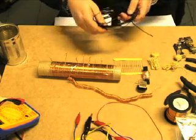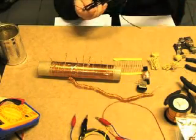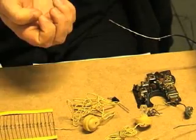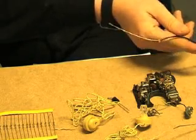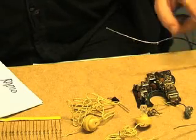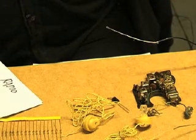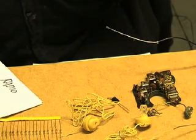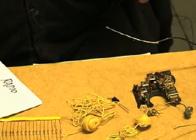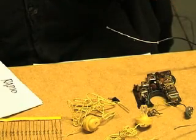A very crucial factor in crystal radio is the antenna, or as some people call it, the aerial. You need to have as much of the aerial spread around the space as possible. If you have an antenna that's only 10 feet long, you are not really going to receive anything. From this table I have 20 feet of wire going to the window, and outside the window hanging down is about 55 feet of electricians wire. That's really the smallest you can use. In an outdoor setting where you have more space, you could have 200 feet of wire.